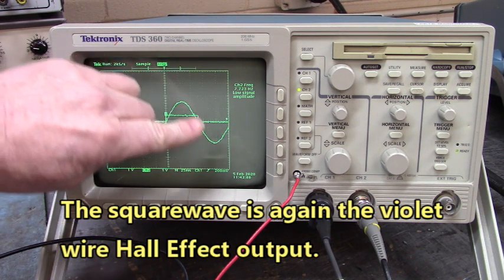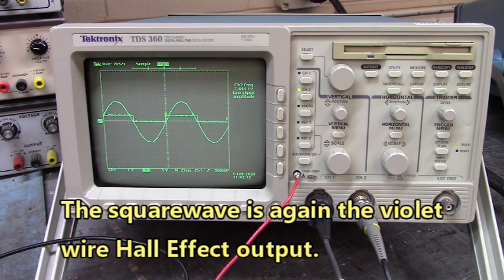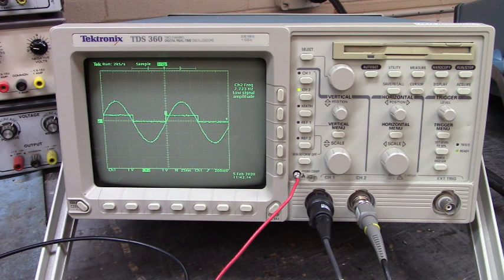And we're back in time now. This also works for the generated waveform of U and V, U and W, and of course what we're looking at now, V and W. Now there's a difference — let me show you the difference when we are looking at the generated waveform of U and W.